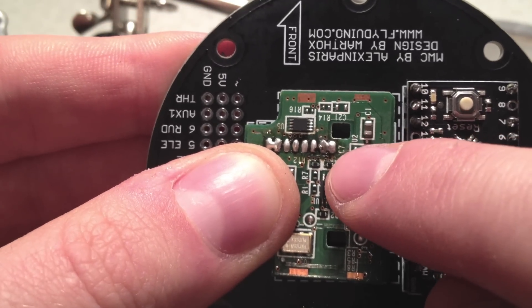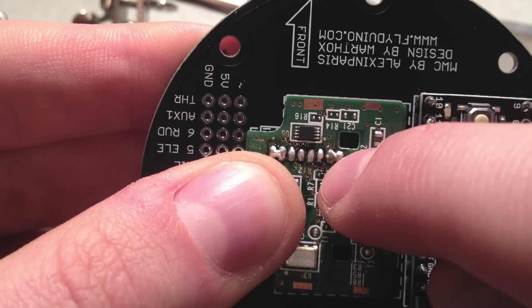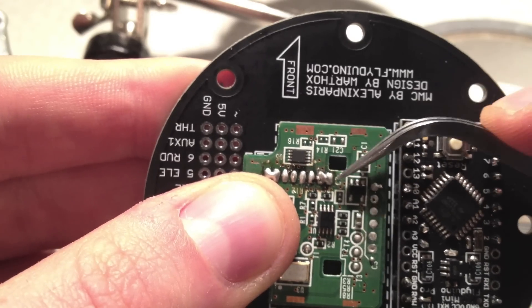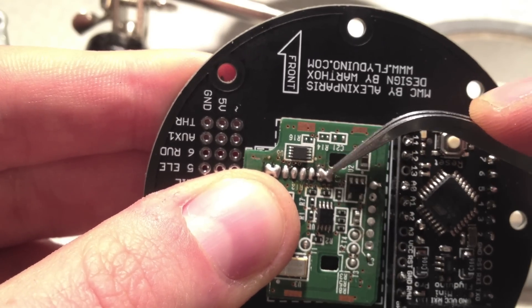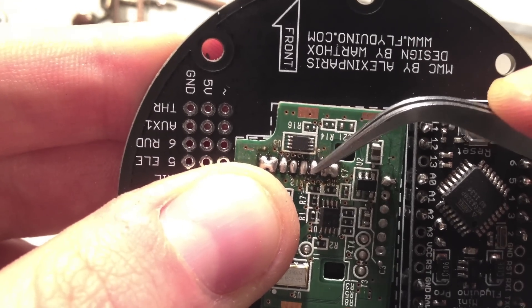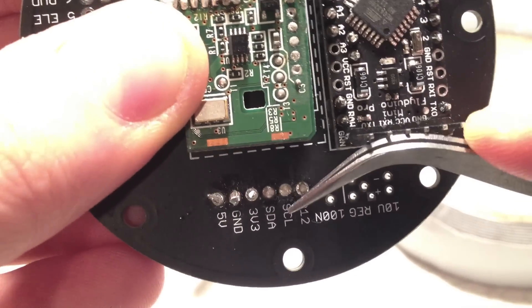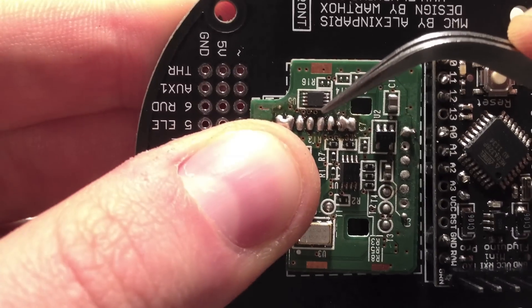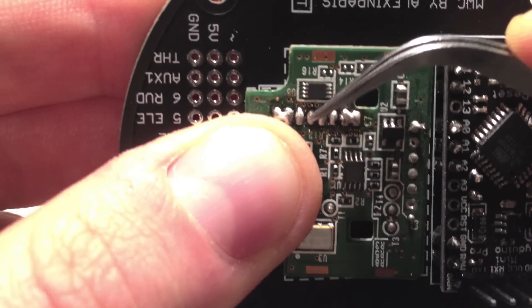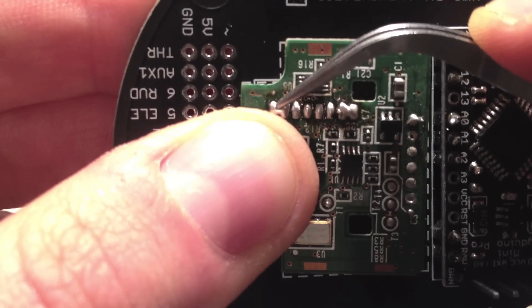The connections are on the V-Motion Plus. D12 — these two pins. I'll take the tweezers so you can see it better. These two connections are going to D12. This connection is going to SCL. These two are not used. This is going to SDA and these two are going to Ground.